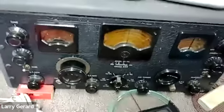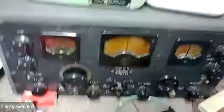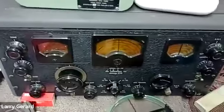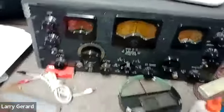John, when you go on your SX28, you'll figure out what the difference is on this one. This one, on the high bands, when you turn the RF gain and everything all the way up, goes into oscillations in certain spots on the dial. So I did something wrong, or got something misadjusted. We'll see how yours operates when you get yours going.